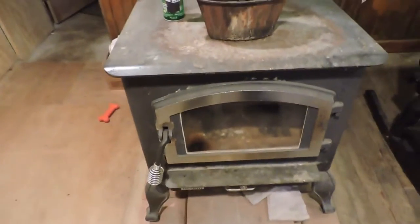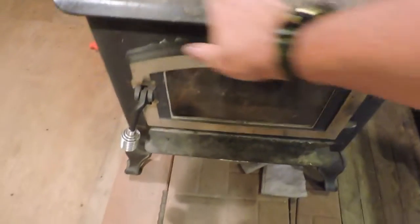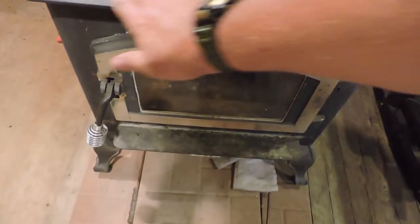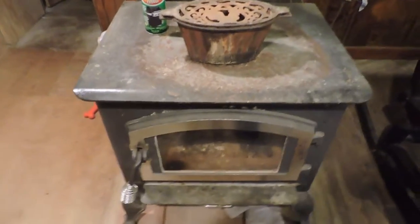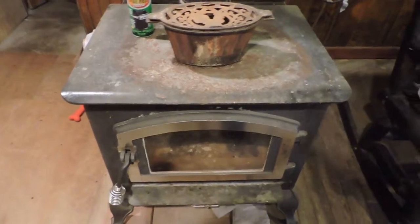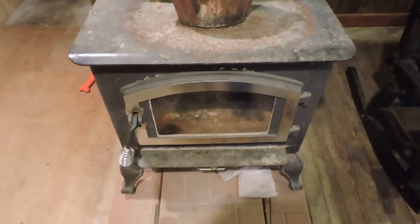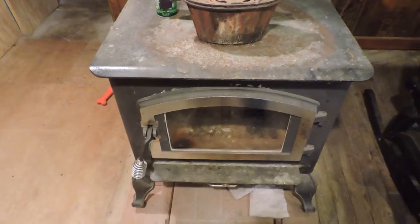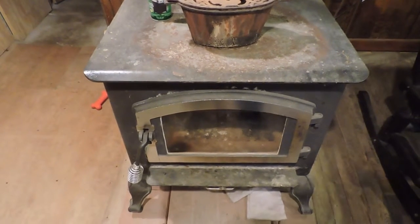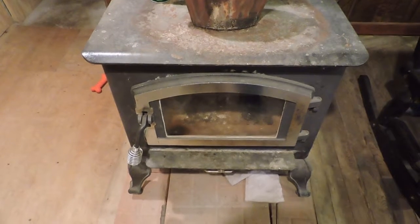And also on the underside of the heat box, down in the top of the stove, there is a piece of specialty insulation board that's there to hold the heat rather than have it just escape as quickly. It helps it to recirculate and makes the stove more efficient. That's gotten damaged over the years. This stove's been in use for 4 years now, so I have to replace that. That's on order. That's nothing I could get locally. I had to order it and have it shipped. So when I get that, I'll put that in too.